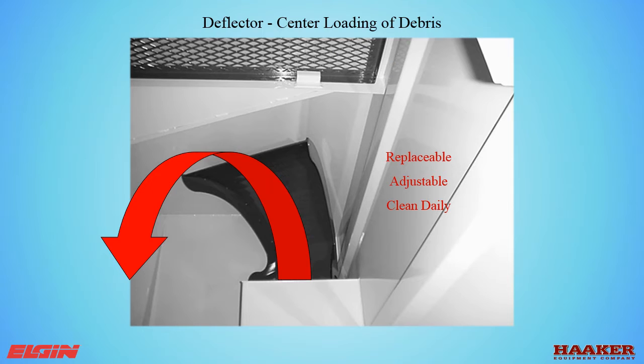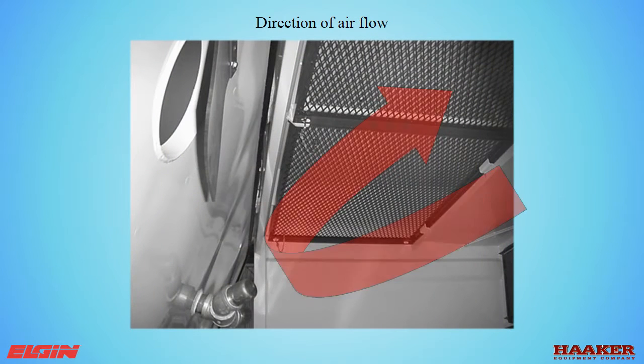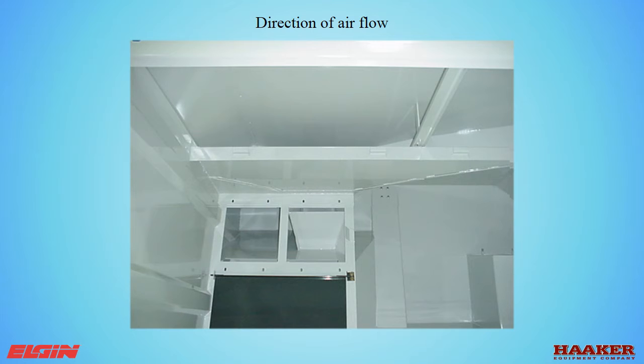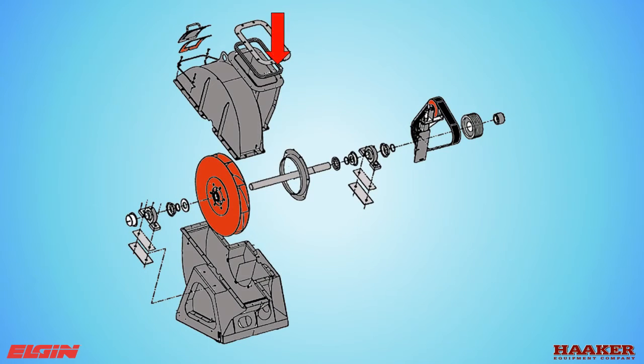The air as it goes up the suction hose is at a high rate of speed, carrying all the debris. When the air enters the body, that air speed dissipates and the debris falls out of the airflow. The slower air is pulled into the screens that catch lighter items like leaves or paper. After going through the screens, the air goes to the left corner of the body and into the dust separator, where it makes two hard U-turns. The debris is centrifugally thrown outward, hitting the walls and sides, then falls into a clean-out. The cleaner air then goes back to the fan, and the process starts all over again.